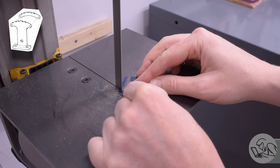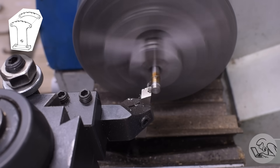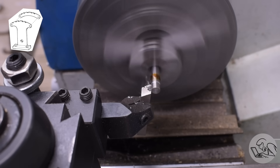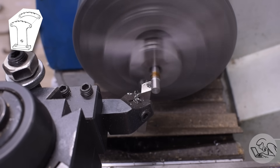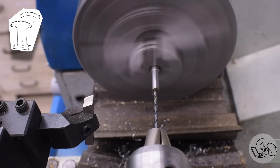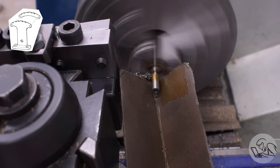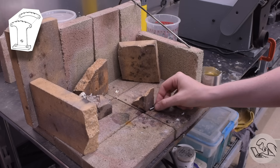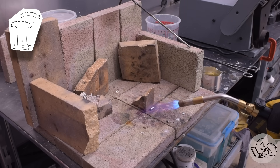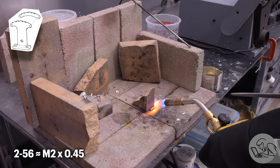I'll use the bandsaw to cut off the excess from those side cuts. Now I need to round the ends of those arced sections, and like any locomotive builder I've accumulated a lot of waste around the ends of things. This time I'm going to use filing buttons because of the tricky contours. I turned and drilled some tool steel to the appropriate diameter for our radii, then took them over to the hearth and hardened them. I calculated the hole diameter to be a close fit around a 2-56 bolt, and you'll see why in a second.